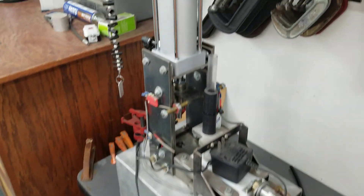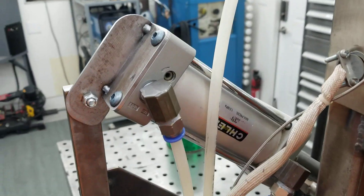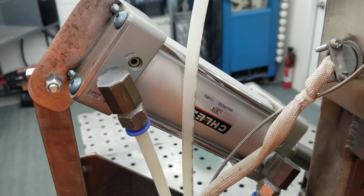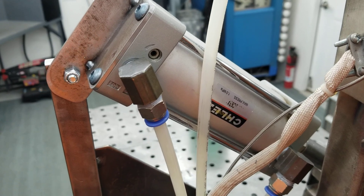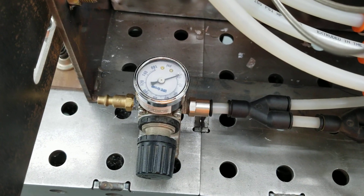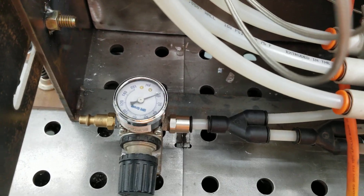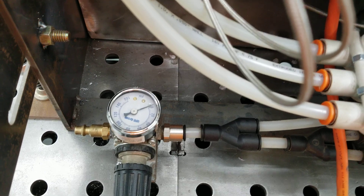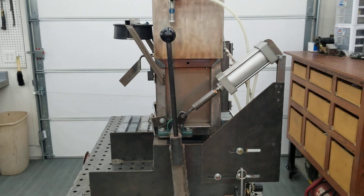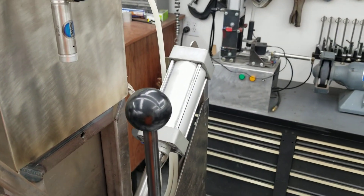So now I've gone to a larger cylinder, which I had on the sizing machine — there's another video of that. The difference is that the large cylinders have cushions on the ends, so you can adjust an allen screw on each end to slow down the movement at the end. Then with the flow control valves and setting the pressure where it needs to be, it gives you enough control to make the machine move smoothly. Now I'm down to 25 psi to operate it, and with all the adjustments the machine returns to the top of the stroke gently.